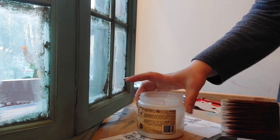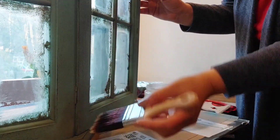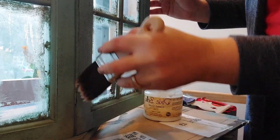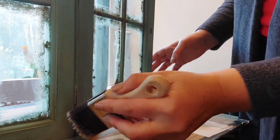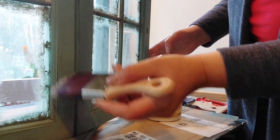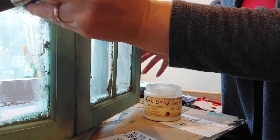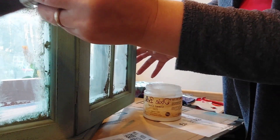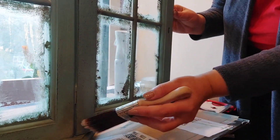Now it's time to apply some protection. I'm going to use Dixie Belle's Clear Coat in Flat because I want a nice flat surface, and I'll apply two coats — two coats will be more than enough for this more decorative piece. I'm applying this in thin coats using the Dixie Belle mini brush, which is a synthetic brush that makes applying liquid top coat so easy and fast. With liquid top coat, you don't want to overwork it or put on too much — work with small amounts, and if you miss a spot on the first coat, you can fix it with the next coat.